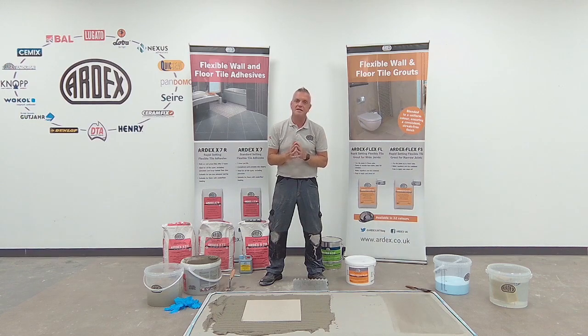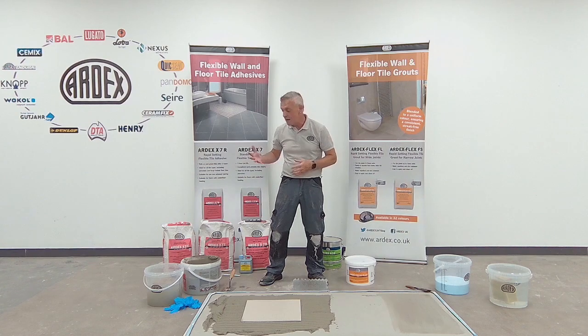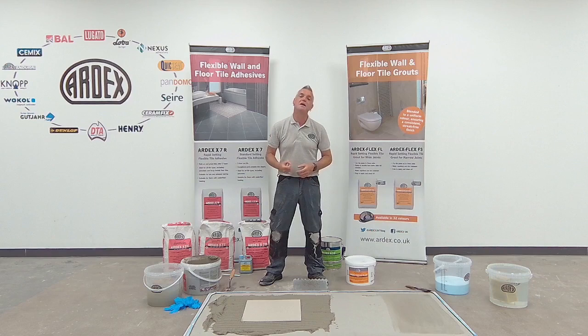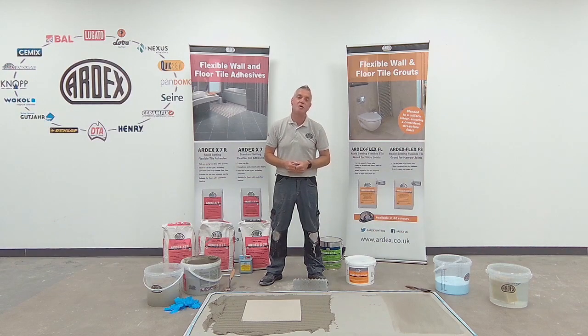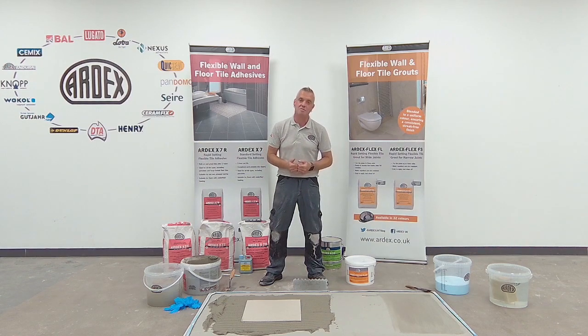Just keep in mind, think about what you're doing when you're starting this project. If possible, work at different times, like early in the morning and later in the evening. These are options you've also got, as well as the products and what you could do to minimise the risk of creating heat in the product. When mixing products up, don't do it at fast speed. Make sure you keep it at a slow speed. Wash your tools after each of the mixes, and wash your buckets out. All these factors will help you ensure that you get the maximum open time and pot life, and the product won't have any issues with regards to shrinkage and cracking.